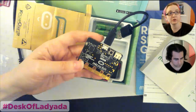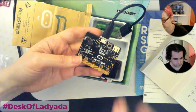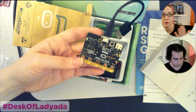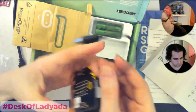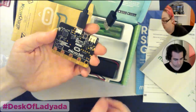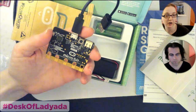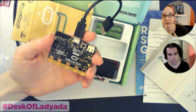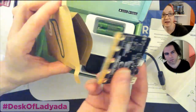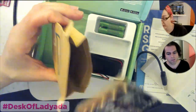J-Link even released firmware so you can use it as a J-Link device, saving you about $300 — though you can only use it on the board itself. The DAPLink also does drag-and-drop: the board shows up as mass storage and USB serial, so it acts as USB serial, mass storage, and an HID interface device. You drag and drop a hex file to program it. You can also use it as a UART to communicate through a REPL or send serial commands. One reason we went with SPI flash is it's very challenging to make drag-and-drop firmware work on every operating system — we had that struggle with the mass storage driver for the 32u4.